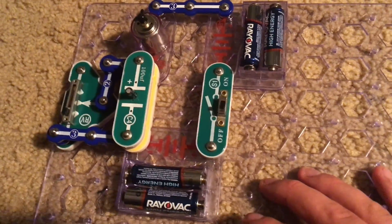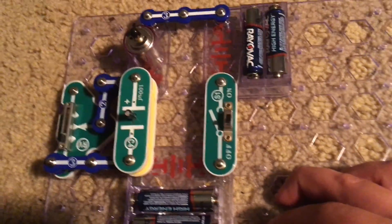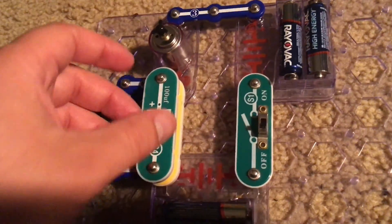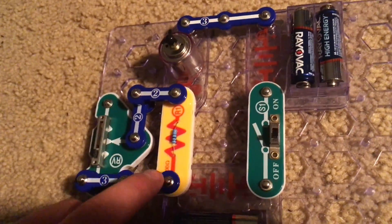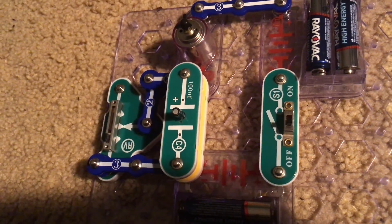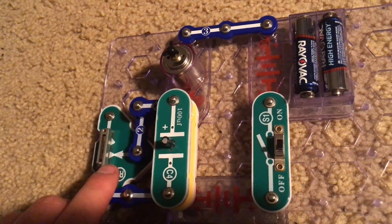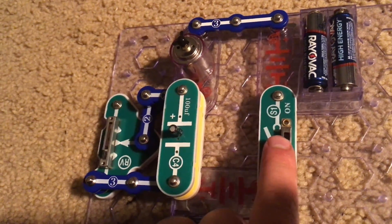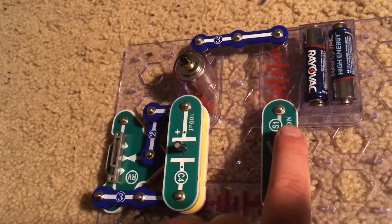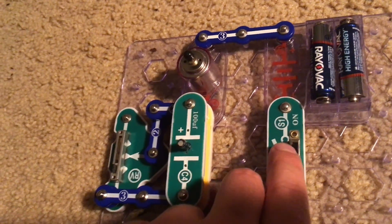Project 141 is slow motor start. We use the same circuit as in the previous project but we add the C4 capacitor over the R1 resistor. Make sure the positive side of the component faces toward the motor, and with the RV on the highest setting we will turn on the slide switch.